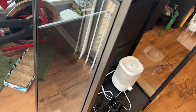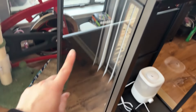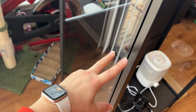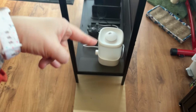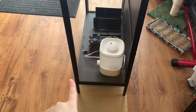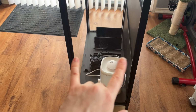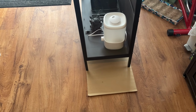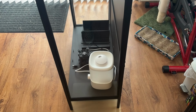If you use my weather stripping, we did 2 layers of weather stripping across the bottom. 1 layer, 1 layer, 1 layer. That's just because of the way the spacing between piece and piece was on each side. One thing I've noticed, and I'll come over here on this cabinet, is that as you're assembling, there are the pins that go in. It's tighter along the bottom, and then in our box, which didn't have damage or anything, it bows out a little bit in the middle and then gets tighter again on the top. So the gap may look just a little bit uneven. Of course, if you need it to be super tight and you don't want any humidity leaking out, then obviously you can get a thicker weather stripping or do another layer.